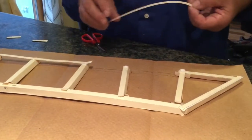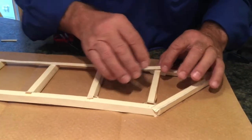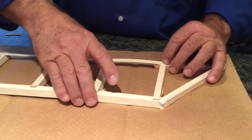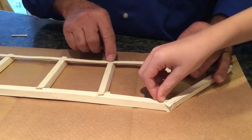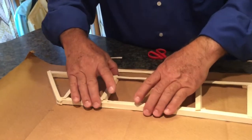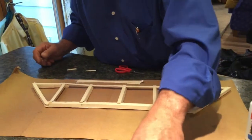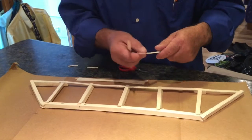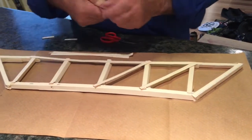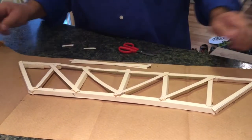There's going to be an overlap here. I've already put glue on that side, so I'm going to push this over to the mark, get it in place. When this side dries I'll turn it over and put these two on the other side, but first this part has to dry. You can already see our truss is taking shape. These I'll glue in similarly, and these — once it's dried up — are going to be my diagonal bracing to help offset the shear. Then it'll be easy to glue those into place and that will complete one truss.